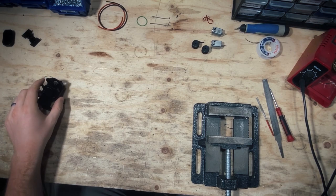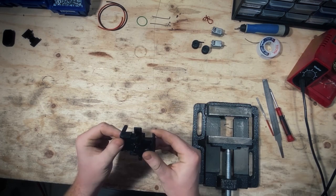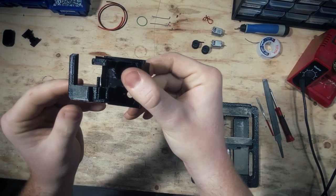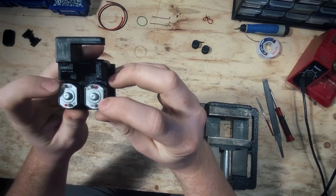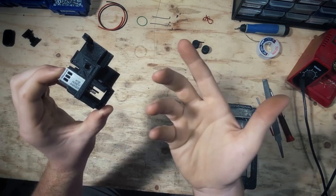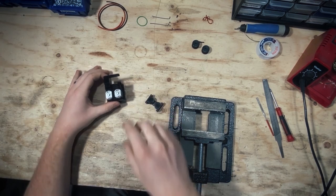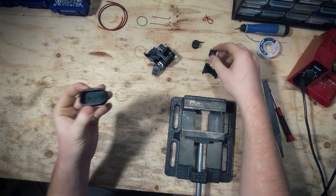Next up is the soldering, which may sound scary — I'm not perfect at this. We're going to make sure our cage is clean, there's room for the motors, nothing is in the way of the dart path, and we keep that peg safe. We're going to mount the two Honey Badger motors in the cage first. Make sure the red and clear/white wires are inverted — that's really important to make sure the motors spin in the correct directions. The way I like to remember is: put the letters out — if the letters are pointing out, you're good to go. Be careful with the tabs; they bend easily and can break off.